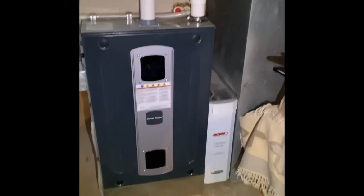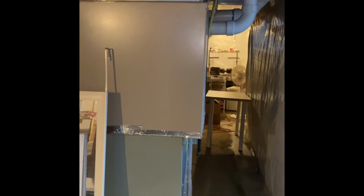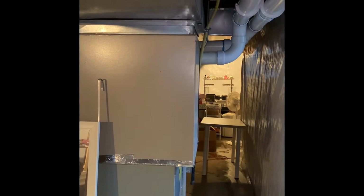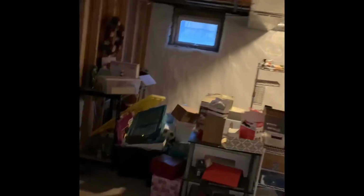All right, down here in the basement, we've got a furnace we installed, media. Looking at just the AC this time. So, coils here. We can always pull it off the backside so we don't have to do anything with the PVC. Line set goes out that way so we can flush in place. I'll put on a checklist what we're doing.